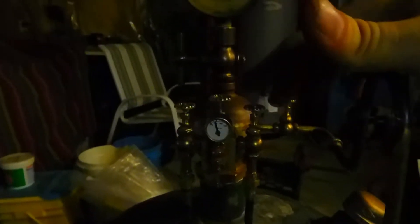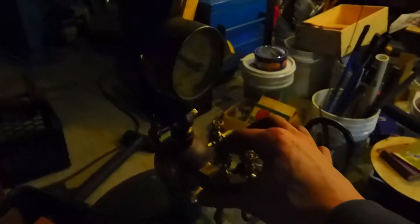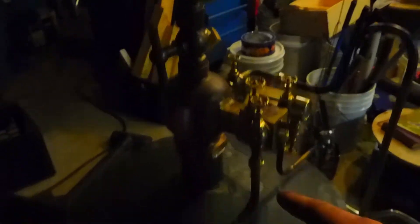This valve is also used in shutting down the burner. We can ensure that the burner control cock is closed — which it is. Now we open up the service valve. Main valve is open, service valve is open. We now have that compressed air pushing that kerosene up the draw pipe in the middle, through this coaxially ported head that I made and the valve block that I made, and out the service line.